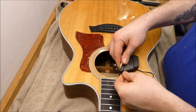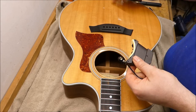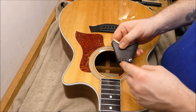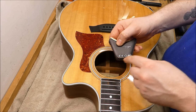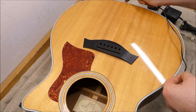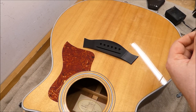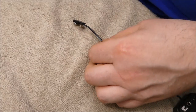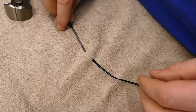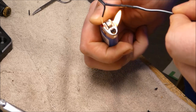We should figure out the power supply here. They give you just enough cord to reach around in the upper bout, so we're going to have to do some surgery to that to make it long enough to reach the end block. That connects using this little clippy device here. I wonder why they didn't use the standard 3 millimeter jack — maybe because there's already two on there they don't want to confuse you. We should make sure we get the positives and the negatives in the right place. I've got a piece of spare two-conductor cord from an old power pack which should do nicely. I'll use the supplied battery connector, cut it off leaving enough that I can splice on the required length. The most important thing is to remember to put on the shrink tubing before you solder those wires together — it's hard to do it afterwards.